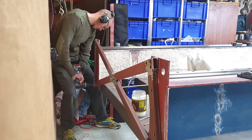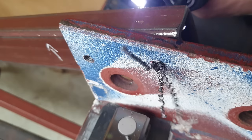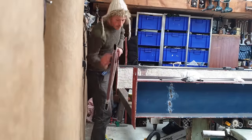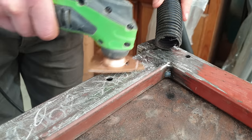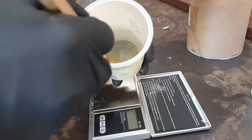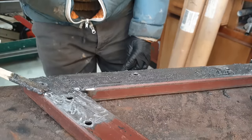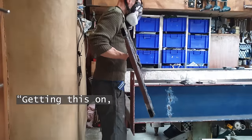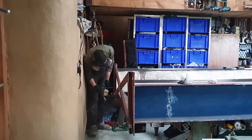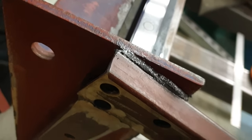Rails can be joined together, though it's not ideal — they need good support and very square ends. I've been fabricating this end piece that's going to brace the two side rails. I don't want to disturb the nice flat set of the parallel linear rails, so I'm going to have a metalized epoxy bonding to one side of this so it becomes absolutely flat and has full contact. It should brace this piece from being tugged back and forth by the ball screw. We want the epoxy to bond to this surface of the cross brace, so it's getting roughened up and well acetoned. I start with a scratch coat of epoxy-rich metalized epoxy scraped into the surface, before a thicker putty-like consistency is mixed up to make the bulk of the jointing material. This type of construction takes a long time compared to welding, but each joint should add some more constrained layer damping, which should cut down on vibrations and ultimately lead to better surface finish.